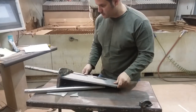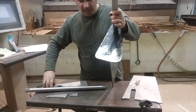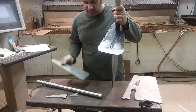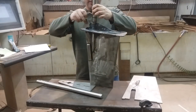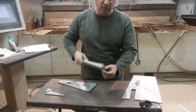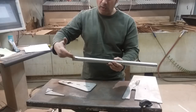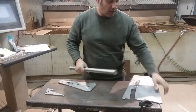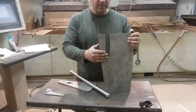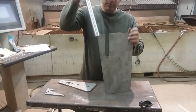Here we have the main plate. It is not an exact duplicate, but it's very close. We have the top plate — also not a perfectly exact duplicate, but very, very close. And then the gussets. Now, we did one thing a little bit differently: those two little keyways are actually in direct alignment with the keyway at the top of the shaft. Those are there so that we can align the main rudder plate directly centered on the shaft and in exact alignment with the top, so we know that everything is perfect and parallel.